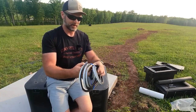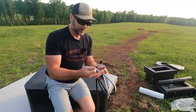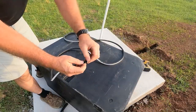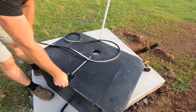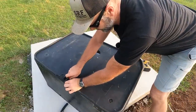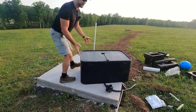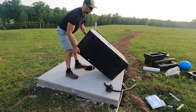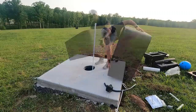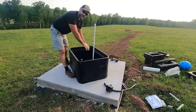The first step in this procedure is getting the Mirafount flipped up and over so we can put our rubber seal on. We'll wipe it clean — if you've got a rag it wouldn't hurt to wipe it clean. We're going to take this rubber gasket, take the tape off nice and gently, and install it on here. This basically keeps contaminants, water, manure, and mud out — because what cows can destroy, they will destroy for sure. We'll place this seal right here on the top of the Mirafount waterer, peel back our strip, and get it started. If you've got a little bit left on the end, just take your razor knife or pocket knife and cut that off. Give it a firm press — ready to rock and roll. This is where I suggest having a helper, but if you don't have one, lighten it up as best you can, set it over in here, always practice good technique, and don't hurt your back.